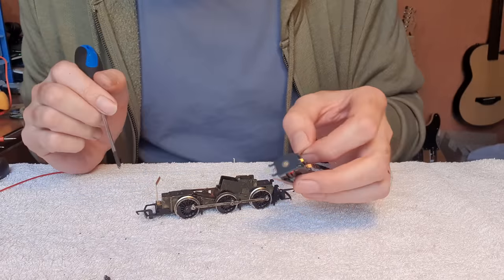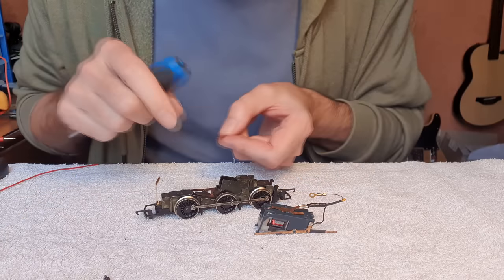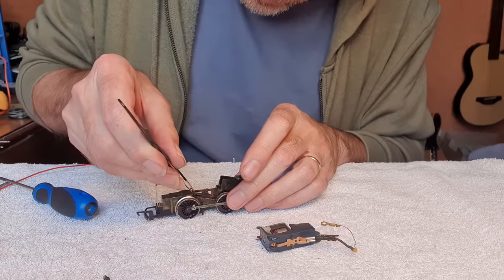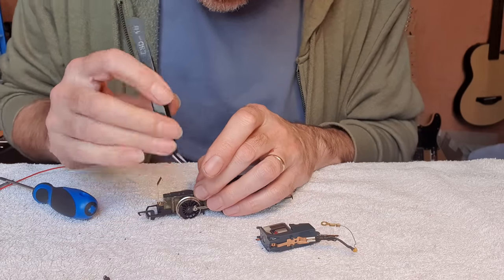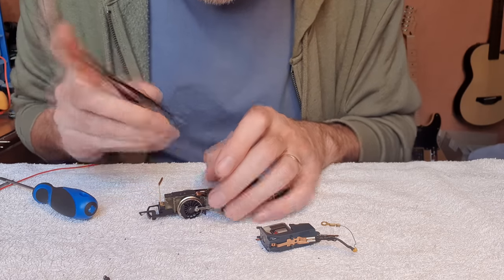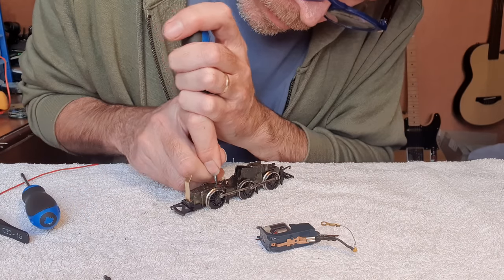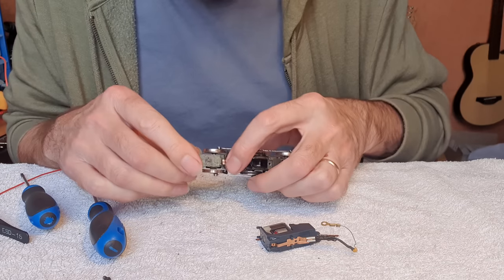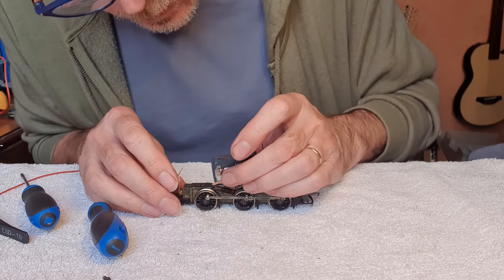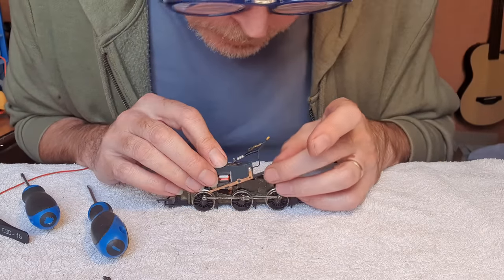Right, I'll have a look at the service sheet and nope, that's exactly as it should be. But there is a little note on the service sheet that says ensure there's a good contact between this bit here and what it calls the claw on the motor. I think what I'm going to do — I've cut a little piece of copper strip here and I'm just going to fold it over. That's going to go underneath the end of the pickup there and sit in that little recess. So now this little contact on the motor hopefully will touch that little piece of copper I've put in, which is in turn touching the pickup.